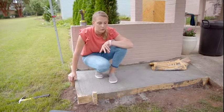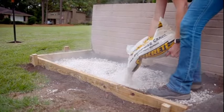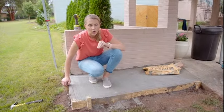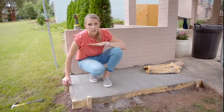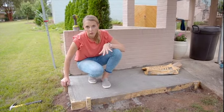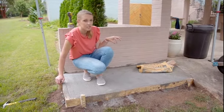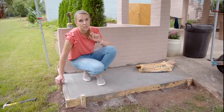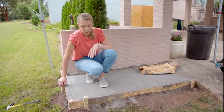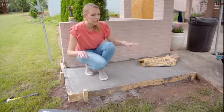Before pouring concrete, I used Quikrete's all-purpose gravel as a base layer within my area and tamped it down really well. It doesn't necessarily have to be level because you'll make the concrete on top level, but it gives your concrete a nice base so it's not going to erode over time. This slab is 32 inches by roughly six feet — about three by six. I needed at least two bags of gravel and then six bags of concrete — six 80-pound bags. So I had the gravel in, tamped it down really well, and then I was ready to mix my concrete.